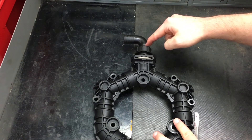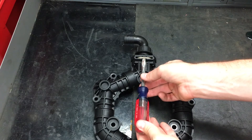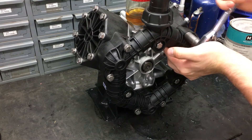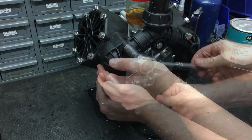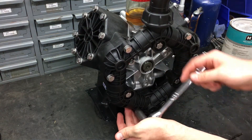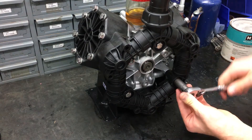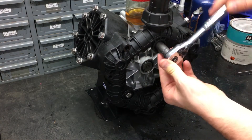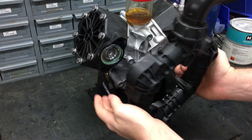To take off the threaded port adapter, use a screwdriver on this spot to lift off the U-clip. To remove the inlet valves on the other side of the pump, again remove the nine fasteners with a 13mm socket. Once all of the bolts have been removed, the manifold will easily come off by hand.